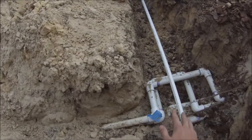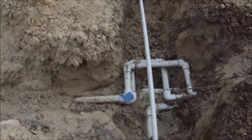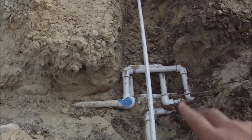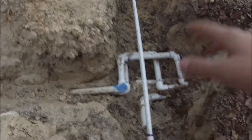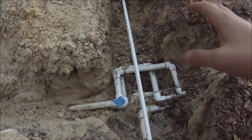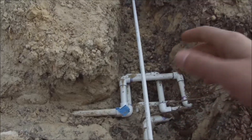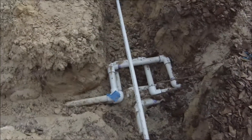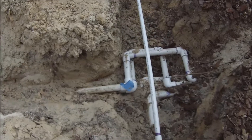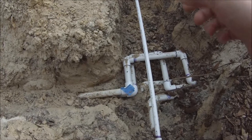This pipe here goes over there — this is half inch, and these are one inch. When they installed this irrigation system in this yard, they used schedule 20 PVC one-inch pipe for all the supply lines. Schedule 20 is thin wall pipe versus schedule 40, which is what most pipe you'll see in Home Depot is. Schedule 40 is much thicker — you can't put a shovel through schedule 40 as easily as schedule 20.